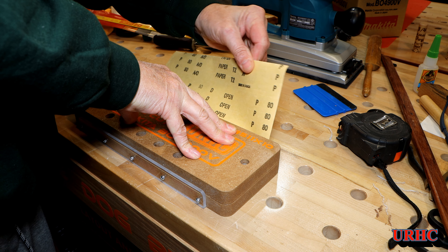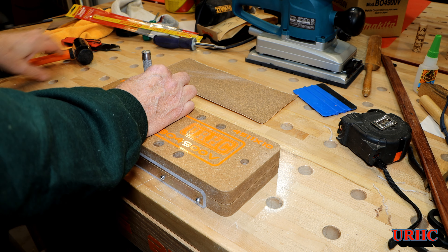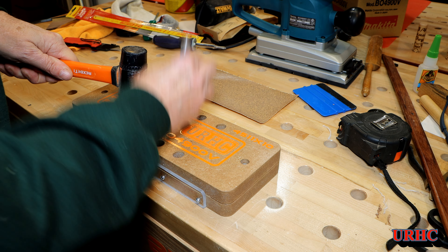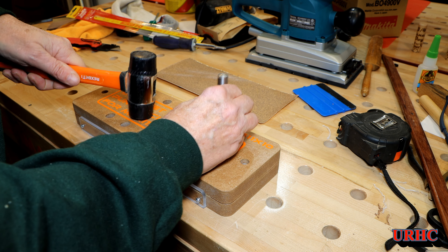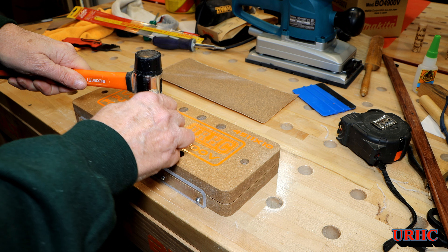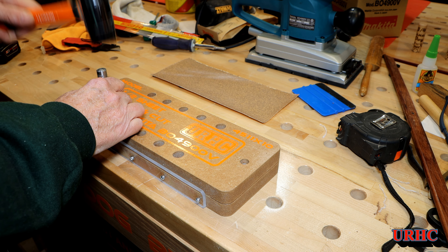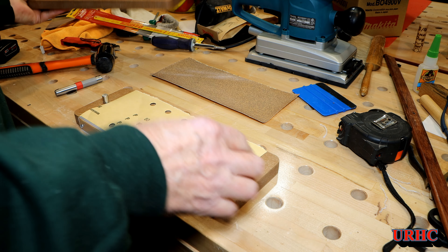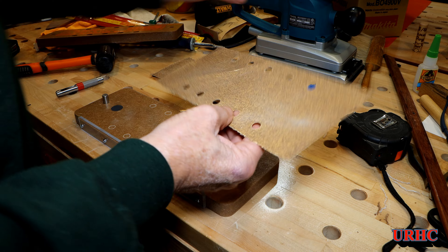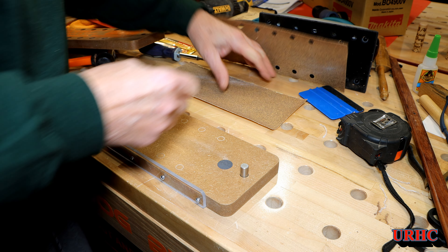There's a real heavy paper — 80 grit — a little tough to tear, but the hacksaw blade seems to do a good job. Using it with the grit of the paper facing down, I think it'll last. It'll take a little time to punch the holes, but they should all be lined up properly, and I'll probably be able to stack two pieces at a time. This should give me factory-quality paper without those little tiny holes that would impede dust collection. First try — came out pretty much perfect, with a little bit of a ragged edge from the heavy 80-grit backing.